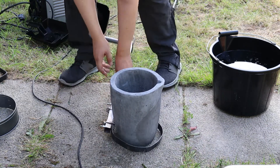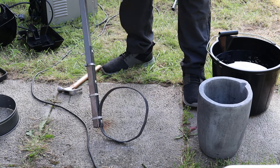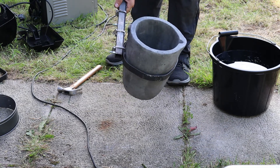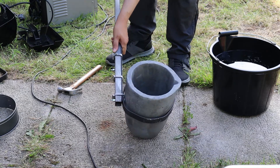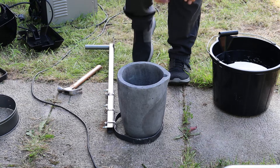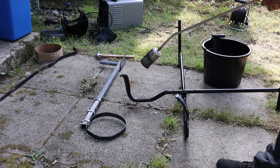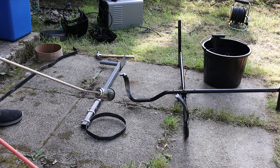Here the hoop isn't very circular so I had to persuade it to fit the crucible. These are my makeshift lifting tongs — they are literally just a cheap keyboard stand whose ends are hammered into a curve. Here I'm trying to pre-burn the paint off before using these tools, but to be honest it didn't seem to make much difference.